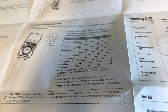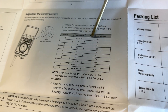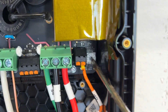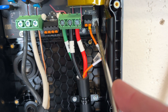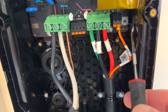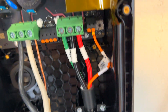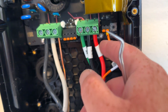Now that we're getting ready to close the cap, we need to set the charger to the right current. They've got a chart here for the number of the dial you're going to turn. Since I used a 60-amp, we're going to get 48 amps, which means I need to be on dial number five. Right here on the right is this dial — it is turned on to six, so I need to turn that over to five. I'll try it with my pick tool. There we go — we are turned to number five, which means 48 amps to the car.